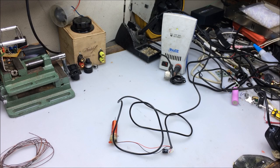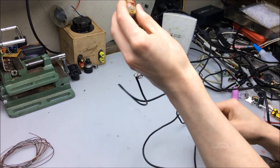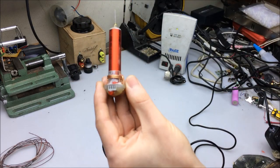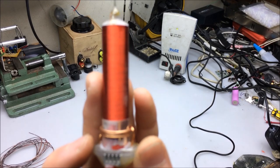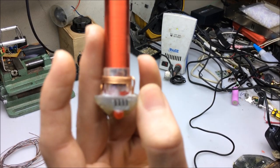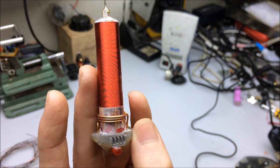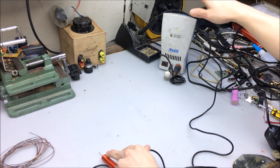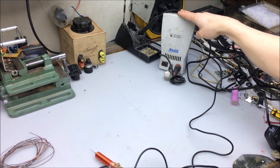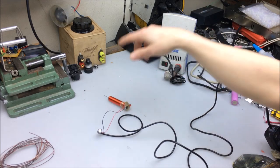Here's how this is going to work. I've made this small Slayer Exciter based Tesla coil from an old syringe, and it uses the 2N2222 transistor. It looks pretty nice. The interesting thing about this particular Tesla coil is it creates a frequency which jams the feedback of the soldering iron that I use. This is a Pace HeatWise 100, and here's what happens when the Tesla coil is turned on.